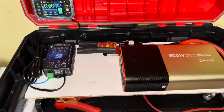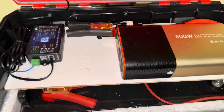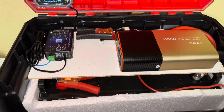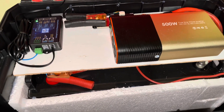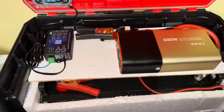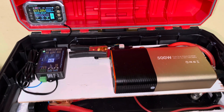This is a pretty powerful little system — it delivers over 700 watts as a gradual increase out of this 500-watt inverter, and pulls well over 500 watts consistently. We have it hooked to a shunt and a battery monitoring system. It's ready to produce power but not yet 100% safe — we need to add a fuse, a disconnect, and a way to charge it. It's a 135 amp hour battery, so we'll need to integrate a charger and get some solar in here, plus add some external plugs. Stay tuned and follow us for this inverter solar generator build — links are in the description, thanks for watching, please subscribe.